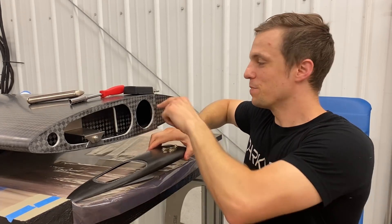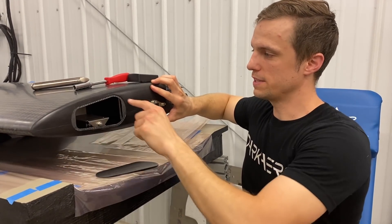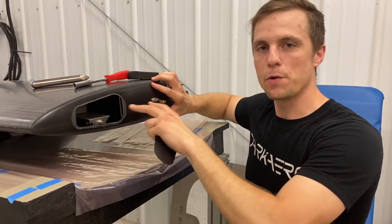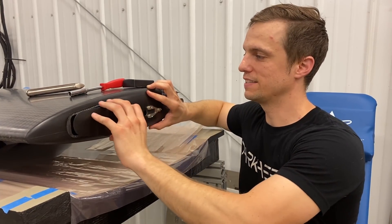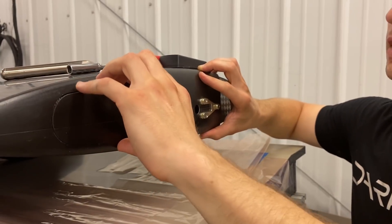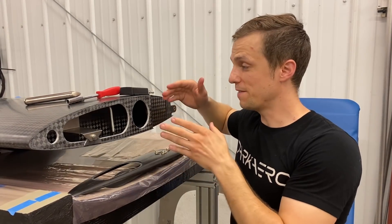In addition to the work with the magnetometer I've also been doing some work on our wing tip caps. Those are going to get bonded on like this. It didn't start out with this access panel — we cut that out on the router and then machined out this lip and bonded it on. We didn't have a design for that originally because we didn't know exactly how things were going to be positioned in here, but now that we have that determined we're able to put an access panel that makes sense. Here's the little panel itself. The next steps are to put a leading edge screw and then an aft edge screw in there to keep it in position, and then we'll bond this on.